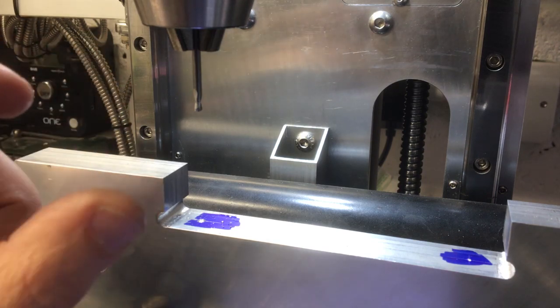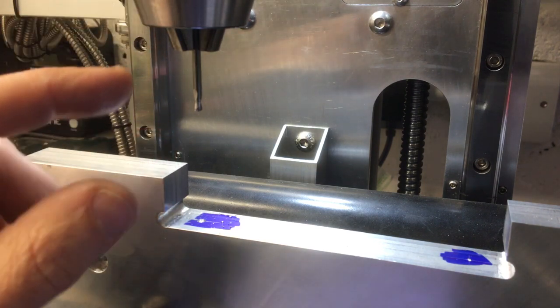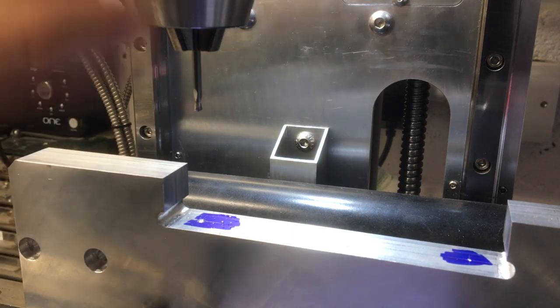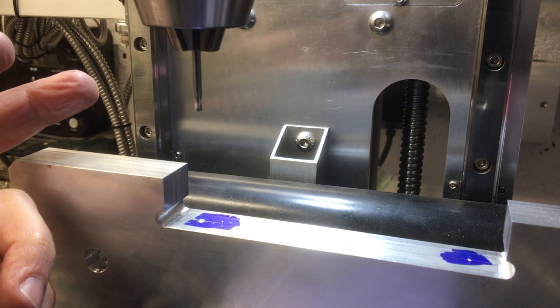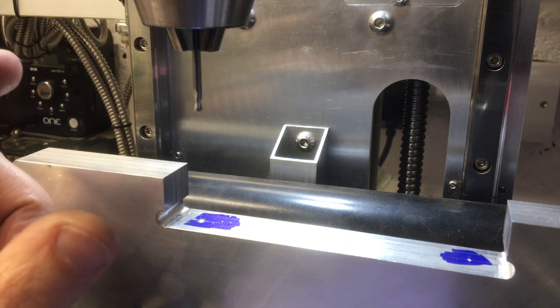While I was drilling that, you probably heard that kind of knocking noise. So it's free play between the spline on the spindle side and the other spline inside the pulley. It's just worn out over all these years of use because it has to slide as well as transmit that power. It's also not helped by the fact the pulleys are eccentric, they're not turned true, they're not running true. So I've decided as a future project I will make some pulleys, and that will help a lot.